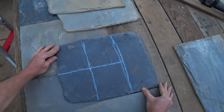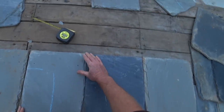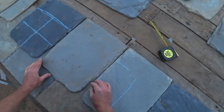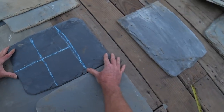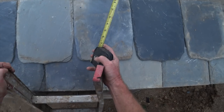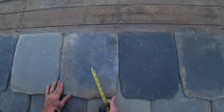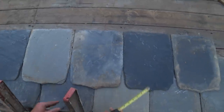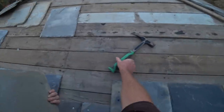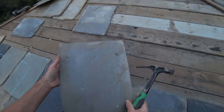This one's a little off too so I'm going to scoot this slate over slightly and just leave a gap here. Chances are one of these slates is the wrong size or these slates down here are a little funky. It's not really a problem to leave a little bit of a gap. I'm confident enough in this layout to start nailing - five and three quarters. I want the holes about two inches below where they are now.